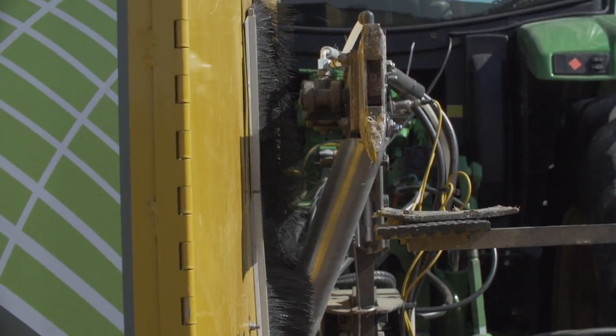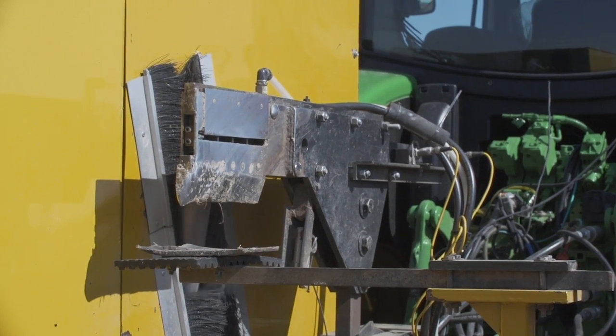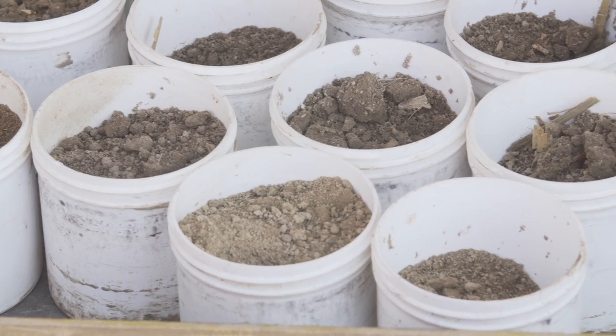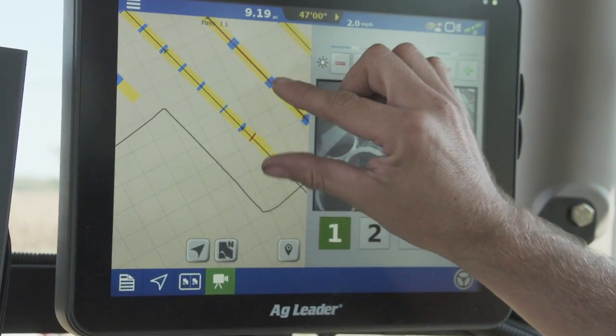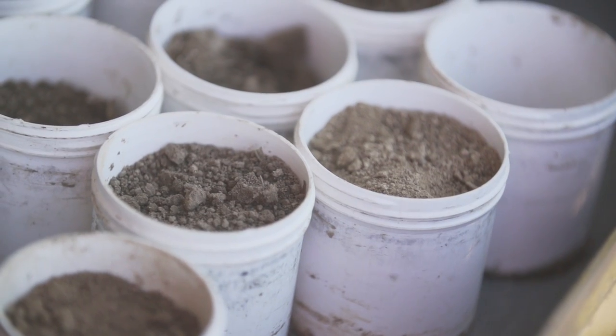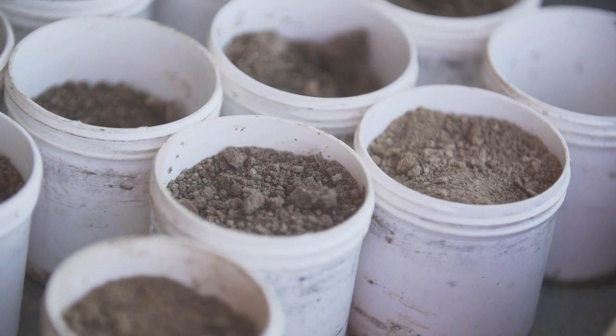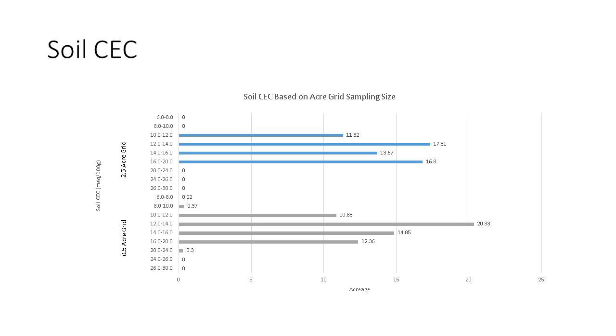From there, the knife cycles back up, and we use high velocity air to clear the knife of all the soil, and it blows into one of these cups. Each cup then has a barcode on the bottom of it, so we use GPS and we mark the location where the sample was taken, and we tie it to the GPS location. That's critical because it allows us to keep track of each and every sample and where it was taken. When comparing the two and a half acre grid sampling size to the half-acre grid sampling size used by the Automated Precision Soil Sampler, we can see a distinct difference, particularly in cation exchange capacity, or CEC.